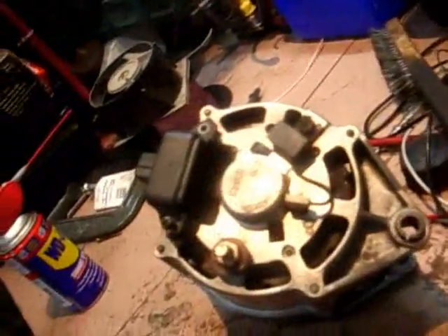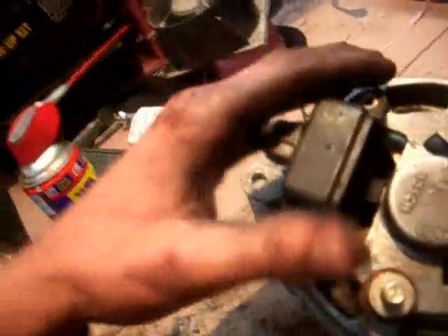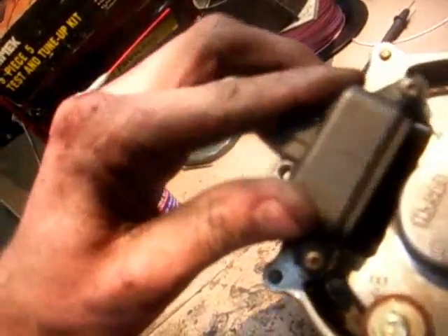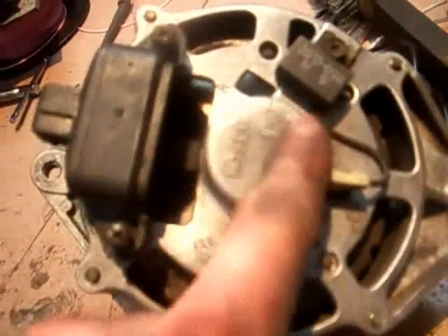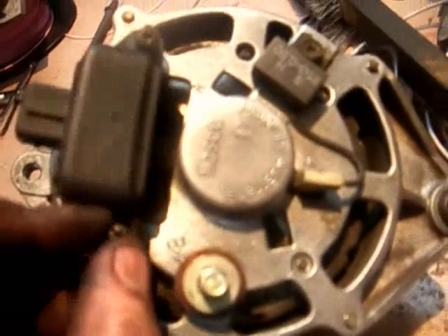So that basically finishes this video - it's going to end up two videos I think because it's pretty long. The rain's getting harder but at least I've done something tonight. I'm happy with this - I'd be happy to put it into any car. I wouldn't sell it as reconditioned, I'd sell it as serviced, and I'd polish it up a bit more and put the slip rings in the lathe and do them properly before I sold it. That's basically how to service a roll alternator. If they're not sealed bearings, grease them, otherwise they'll be alright. Thanks for watching, see you later.